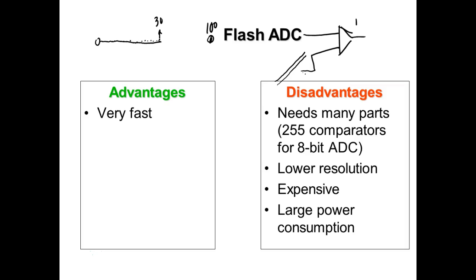What successive approximation is, it's a method where you start in the center. So if my ramp voltage was 10 volts, instead of starting at zero and ramping it up, I'd start at 5 volts. Right, you understand? And then if it didn't match, what would I do? I'd go to 7.5 volts. And if it didn't match, then I would keep increasing it toward the other end. As soon as I exceeded it, then I would start dropping it down until I found it. So successive approximation, I think it's like in four steps, you'll find it within four voltage steps.